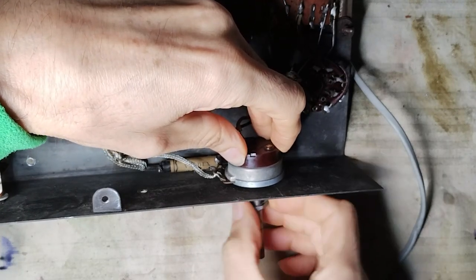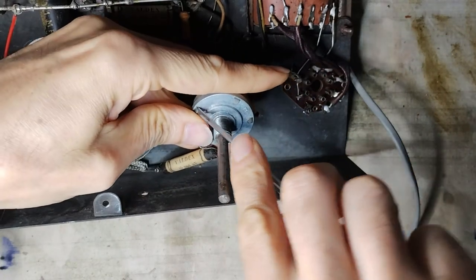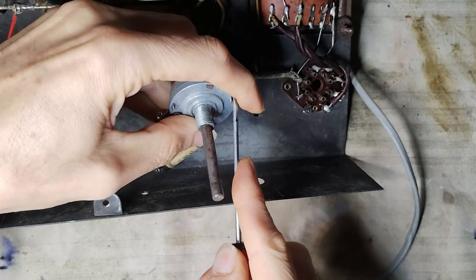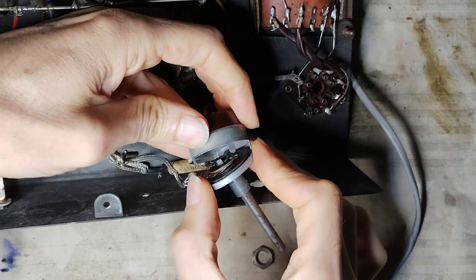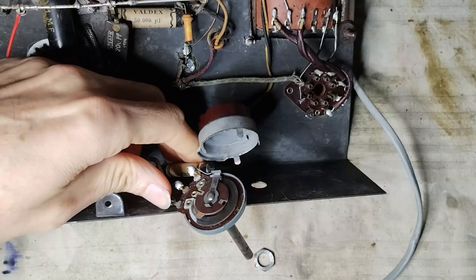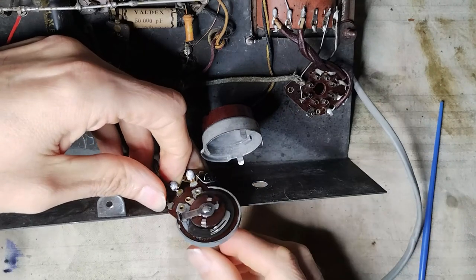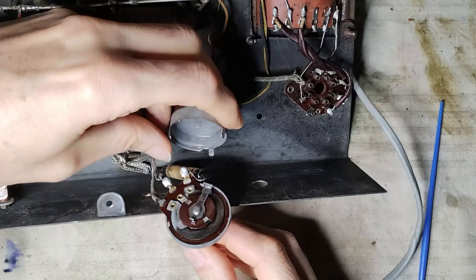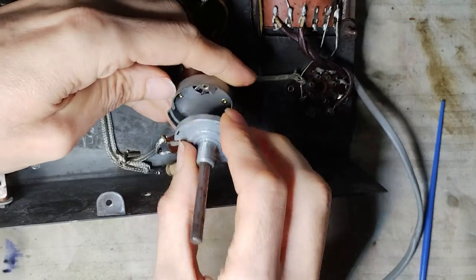As seen while testing the radio the first time, the volume potentiometer needs to be cleaned. For that, it is necessary to open it. Luckily, everything seems intact inside, and some cleaning oil is used. On the back of the small potentiometer case, there is the power switch. Therefore, while putting it all back together, the shaft must be aligned correctly.